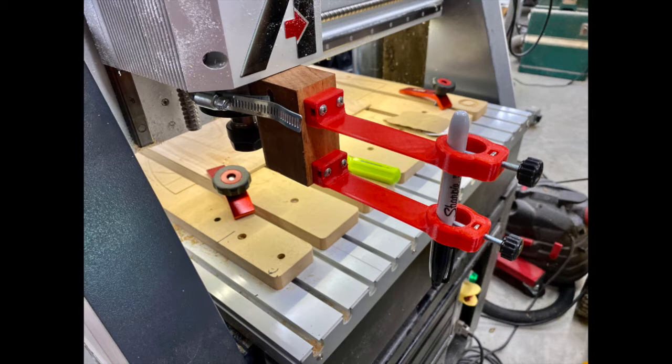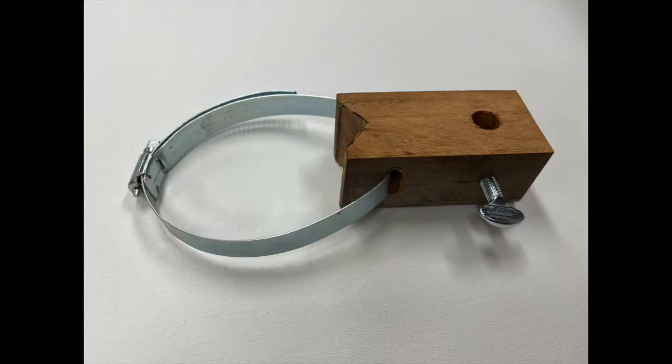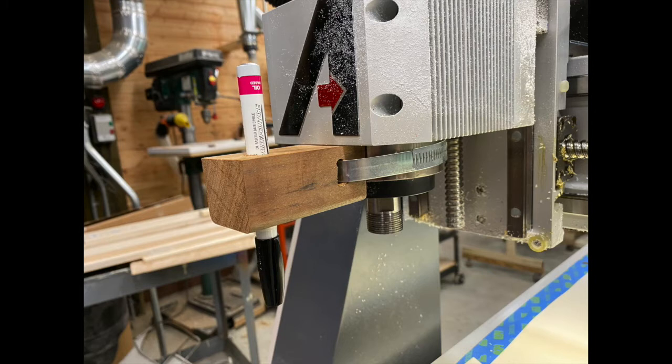The arms provide enough flex to hold the pen down firmly and still allow it to ride up and down a small amount in order to follow the contour of the material. If you are just going to use oil or acrylic markers, you can get away without a spring mechanism of any kind. This is the simple pen holder I made — it took me about 10 minutes to make out of a piece of scrap hardwood and works great. I used a simple hose clamp to attach it securely to the router body. The pen needs to be held tight so that it doesn't wobble, so I used a thumb screw and tapped a thread into the side of the holder, but either a very small wood piece to wedge the pen into the hole or another hose clamp would have worked just as well.